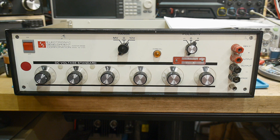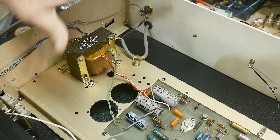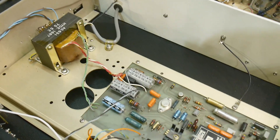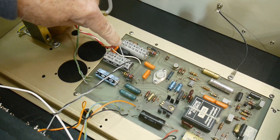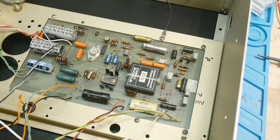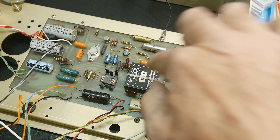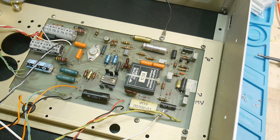So the calibration should be about the same. What I want to see is what I should do with it before I calibrate it — does it need any fixing? Let's take a look inside. We have a completely exposed AC power section, so I have to be careful. The AC comes into a bridge rectifier, you get plus or minus 15 volts, and that runs an op amp. Op amps were big giant things back in the day. This thing dates to 1975, so it has some vintage to it. This is a chopper-stabilized amplifier — you can get those on a chip now.